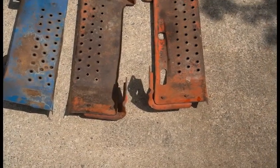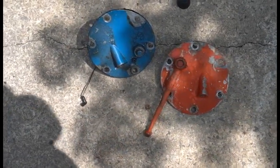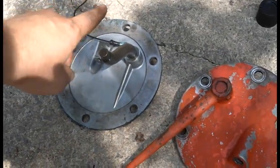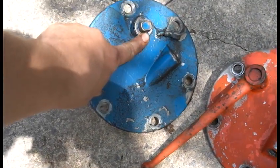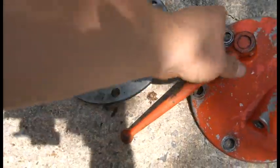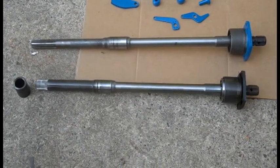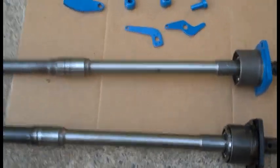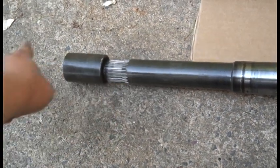The Selecto Speed running board is also a little shorter. For the PTO shifter: a cool trick I didn't know when I bought the Selecto Speed — it has this little arm. If you need to push the tractor you can't just put it in neutral; you have to turn this little knob which moves a collar between the pinion gear and the transmission to actually disable it. Our geared PTO shifter has a shifter on the back instead.